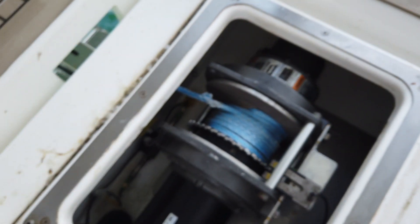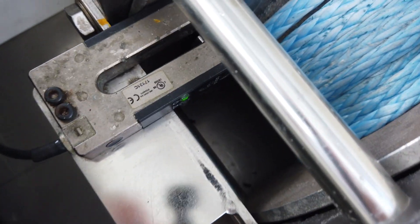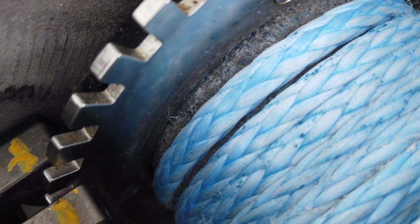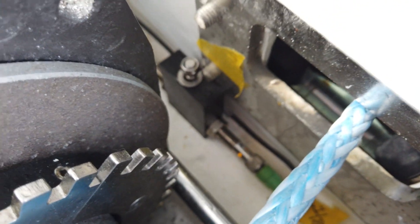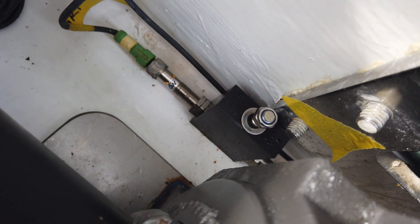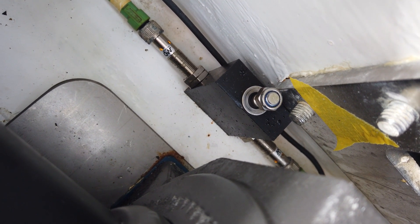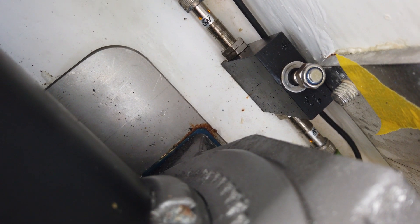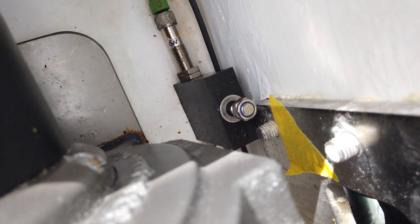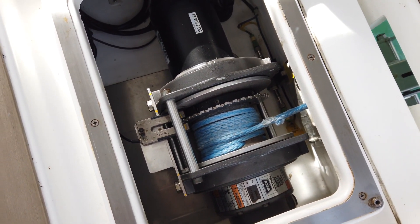So quite happy with that — I'll just clean up around there and put it back on again. It's all good. The whole system is working well. It's a very simple set up — that little counter and the cogs. A little light counts each cog as it goes around. There's a plunger down there with a sensor on either side, so as the arm comes up the bolt lifts up, the light makes contact with it, and it tells the system it's in the correct position and stops. When all's going well it's very simple and awesome — we love it.